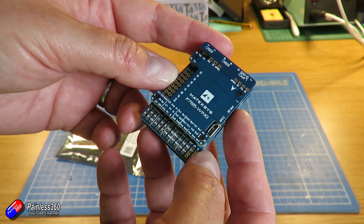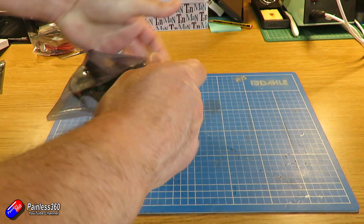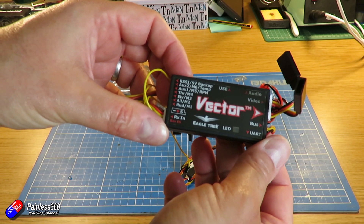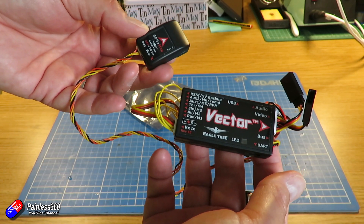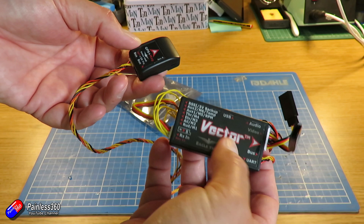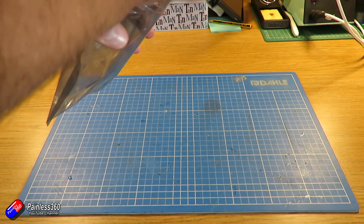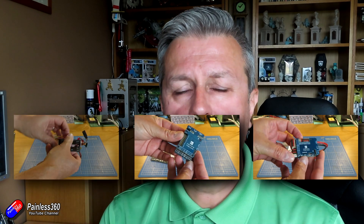The last option is a bit wacky. Those two Matec boards are relatively inexpensive considering what you get. The other one is a little bit more expensive — that is the Vector. I've done a number of videos on the Vector and have an entire series — links in the description. The Vector is really aimed at pilots who don't want to go through all that complexity. It's really plug and play, with a graphical on-screen display and GPS return-to-home functionality — a very good flight controller. However, the GUI is getting a bit outdated and it's relatively expensive given that you can get almost all the functionality, except the graphical OSD, out of the Matec boards.